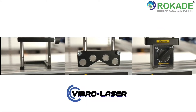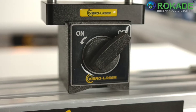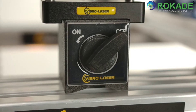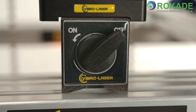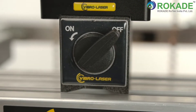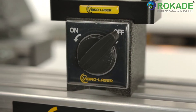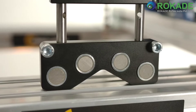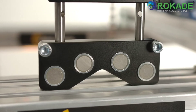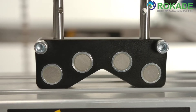There are various types of mounts, each of which can be purchased as needed. Measuring units can be mounted on large diameter shafts with the magnetic base — it is more convenient than multiple extension chains. Magnetic V brackets are used for mounting the measuring units on the side of the coupling with strong magnets when chains cannot be used.